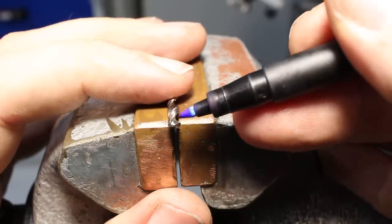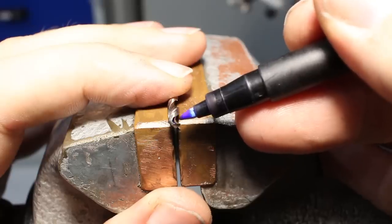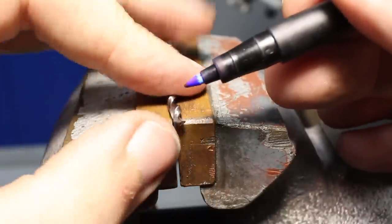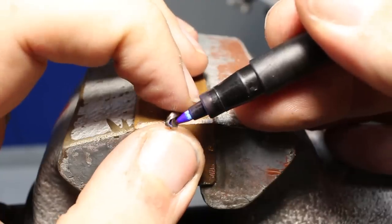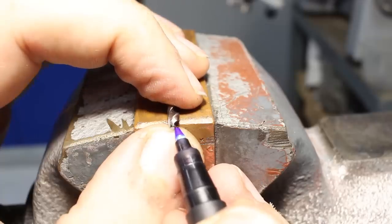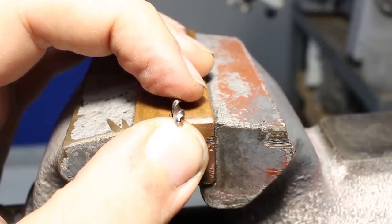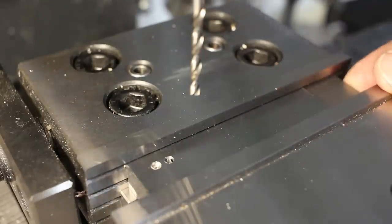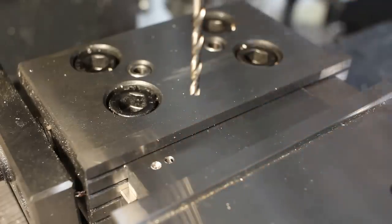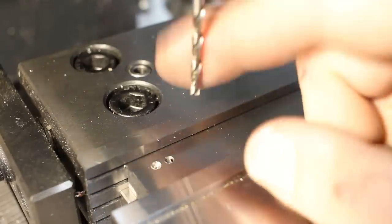Here's a close-up view of the split point. You can see the material I removed here, and on the opposing side — it's not perfectly symmetrical because it's an offhand grind, but it's okay for this purpose. The idea is to minimize the chisel edge — that's the straight edge between the two cutting edges right here in front. You want that to be of minimal length. Back at the milling machine, always make sure your backer piece has solid material under the drill-through point, not a previously drilled hole. Let's try this again with the thinned web, still at 100 RPM.